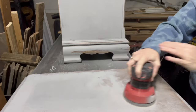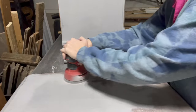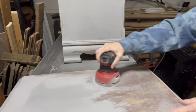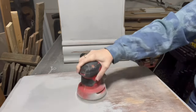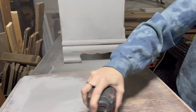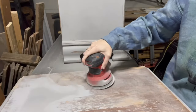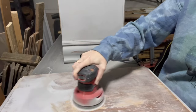I did decide to sand the top piece. I had to go in with a really rough grit — I went with 80 grit — and as I started going and getting my layers off, you can see there was paint, there was stain, and then there was the raw layer of wood. When you're using sandpaper, the lower the grit, the more rough it's going to be, and the higher number, the smoother it will be. I'm starting off with 80 grit, and once I get everything off, we will smooth it out with 220 grit.